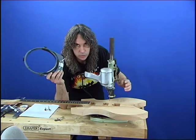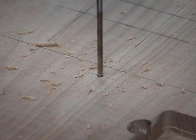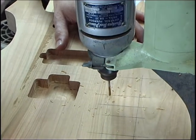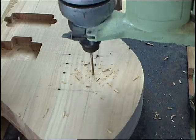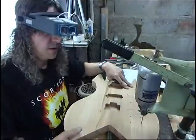I'm going to drill pilot holes with the drill stand right the way through the guitar and then I'm going to enlarge the holes with the hand drill. The diameter of the switches is 6mm, the diameter of the pots is 10mm, so we're going to drill different sized holes through the body. There we are — 9 holes drilled.